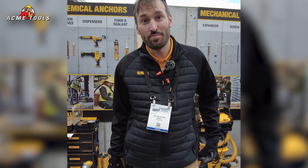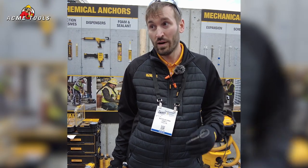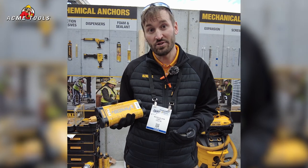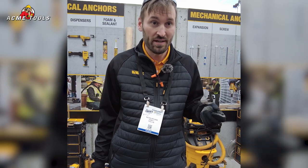So my name is Nick with the DeWalt Anchors and Fastening product management team. I'm here to introduce our new Pure Epoxy Anchor, Pure 220. It joins Pure 50, Pure 110. It performs at over 20% premium to our existing Pure range, so 20% stronger. The formulation is 25% easier to dispense, which helps in colder weather dispensing with our manual dispensers, our cordless dispensers.